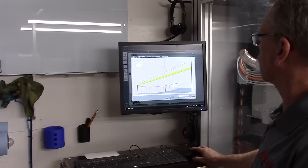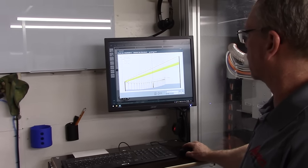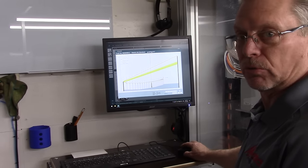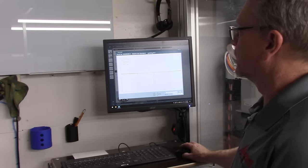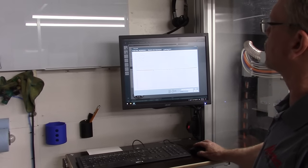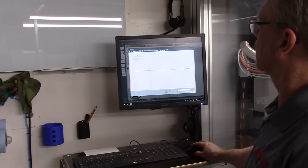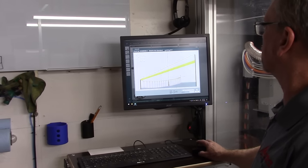So here's kind of like the early thing. Now, if you look at this now, remember, we adjusted the truss rod, we got that as good as we could, then we worked the frets, and we've got those almost dead in line with the green line. The red and the green. If we zoom in, we're looking at thousandths of a millimeter variations here. Here's 0.25 of a thousandth, I believe. So it's just insane, and we can look at every string individually and see that.